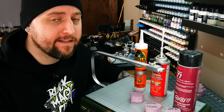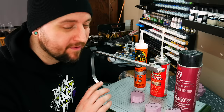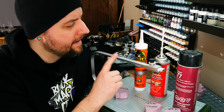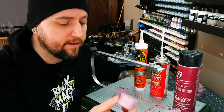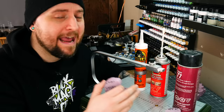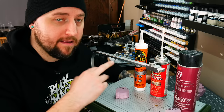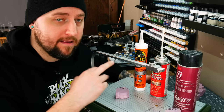So what is my final verdict? I think there are three options, each with pros and cons. The Gorilla Glue Construction Adhesive was easy to use, easy to apply, didn't smell bad, and it cut really well. It probably takes the longest to dry out of the bunch, but it still holds really really strongly. The Great Stuff expanding foam may be the strongest bond of all — it creates an adhesive layer that is essentially just more foam. The downside is it's pretty messy to work with, you can ruin a bottle if you don't use all of it, and it really needs to be clamped together so it doesn't expand and shift.